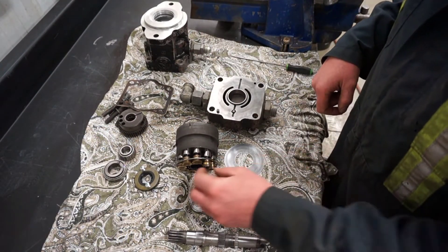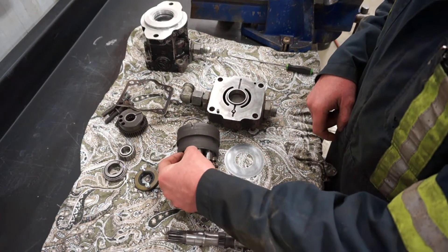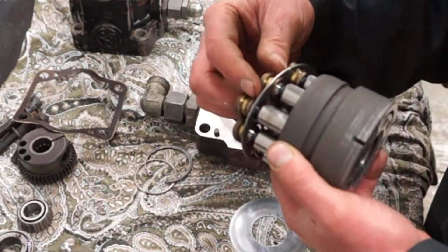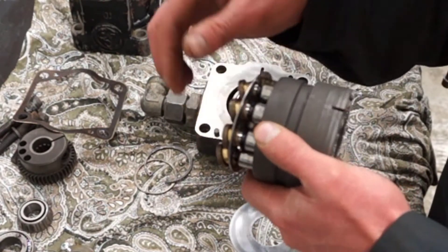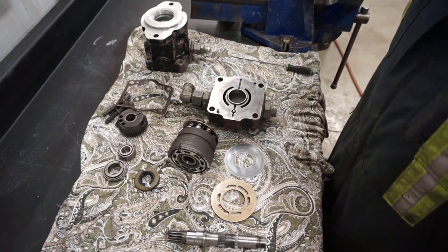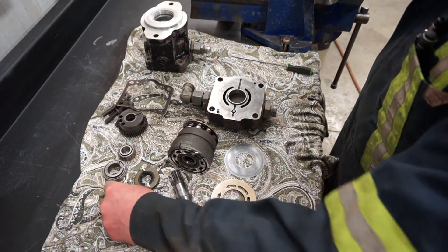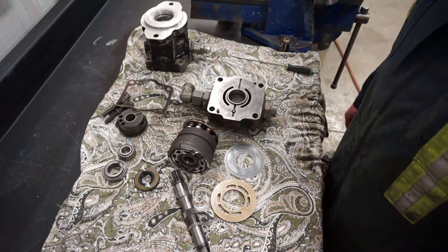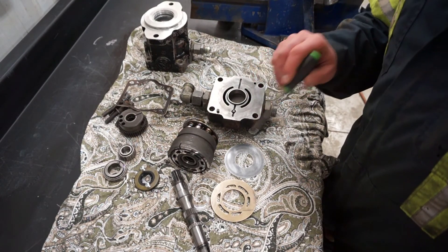The only other area to check is between the barrel and the piston itself — look for scoring. You can polish them. There are some fine grooves, but I can't even measure them with my mics — not even a tenth of a thou of thickness — it's mostly just etching from the oil, so I'm not worried about it. That's it for the rebuild; now we just do a final clean. Cleanliness is incredibly important — way more so than for an engine. Hydraulic components, especially high-pressure piston units, require incredibly clean assembly, and possibly filtering the oil if there's been a catastrophic failure or signs of contamination damage.